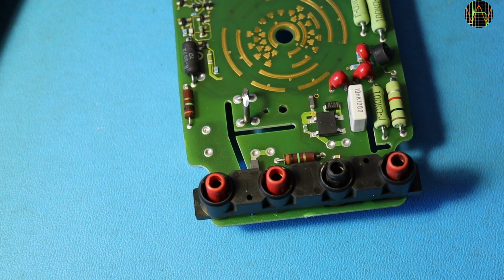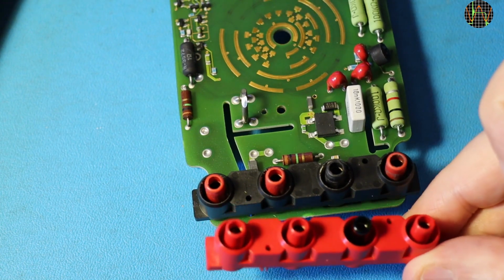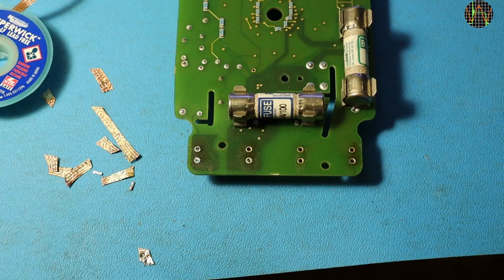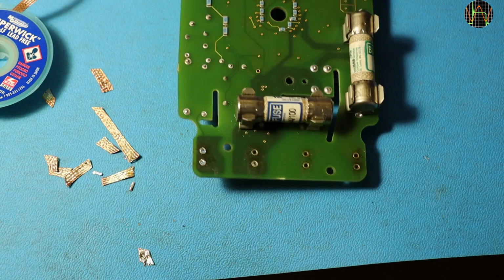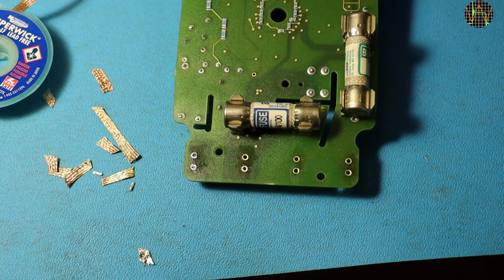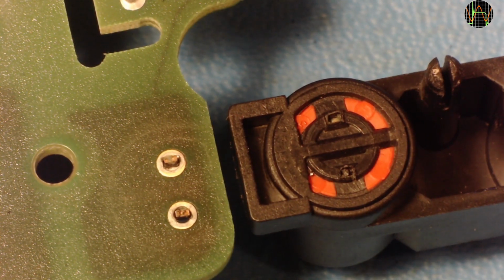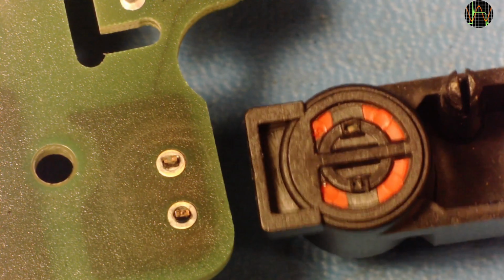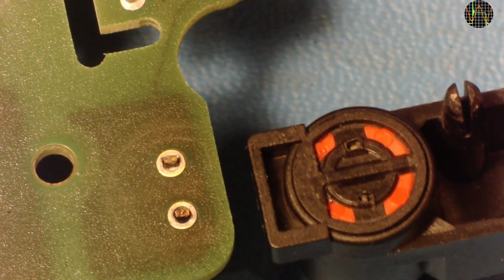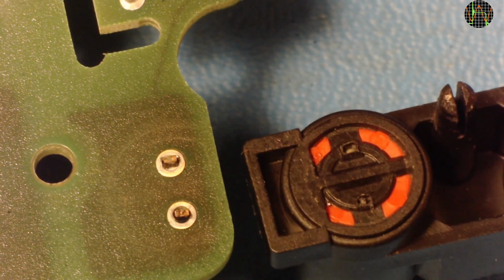Apart from that, the body of the connector assembly is now red instead of black, it looks like a perfect match. All that's needed is removing the old socket assembly. Well, it was a struggle, but using lots of solder wick to suck up solder and gently rocking the assembly did the trick. My guess is that a normal, non-shrouded plug in that socket suffered a violent sideways knock, for example when the meter fell and hit the ground with a plug making contact first.